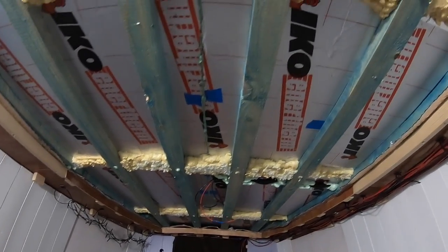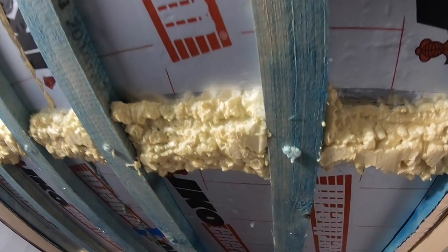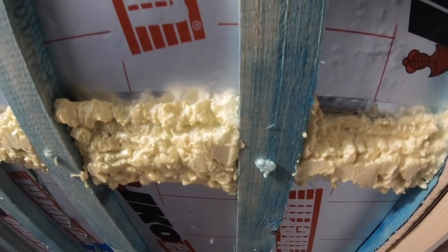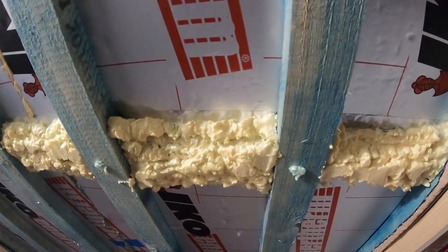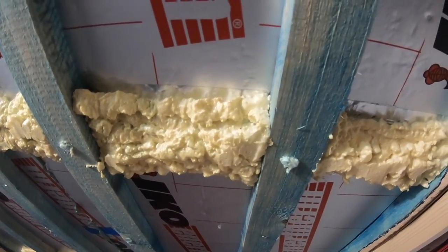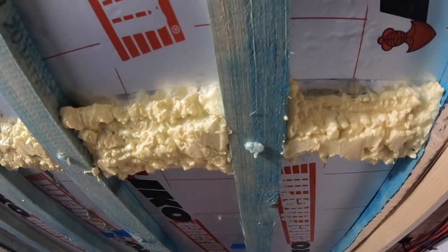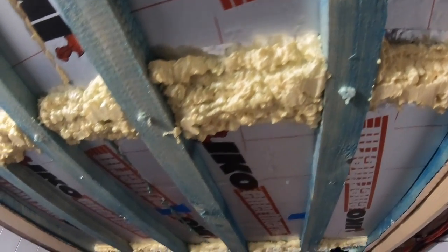Yeah, we've still got a few. I've noticed I haven't trimmed all these off. Oh, I thought I'd done. And again, if you haven't seen any of our other videos, we fill all the holes where the screws touch any metal, so they go through the roof rib, and then we've sealed all those because you do get water around those. We saw it last year because we did those in the winter. We saw how much water comes through from that. Yeah, just sort of bleeds through from the steel.